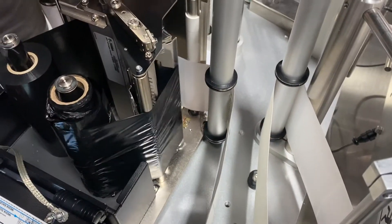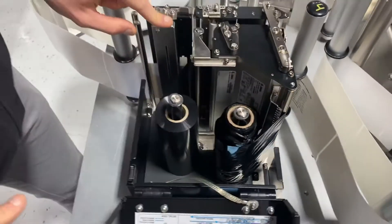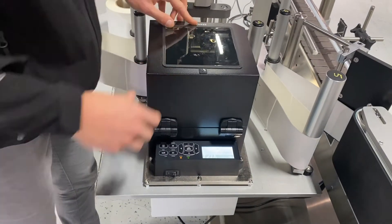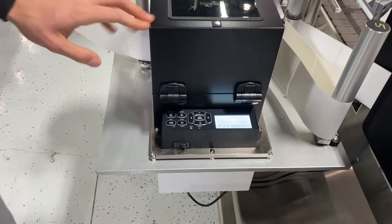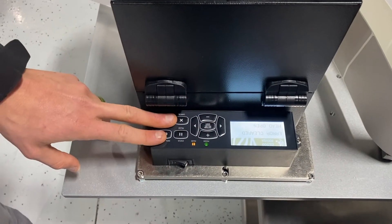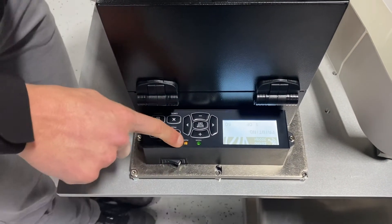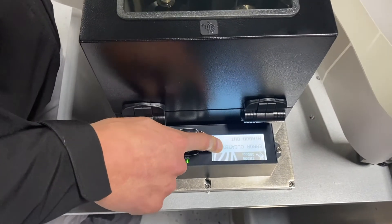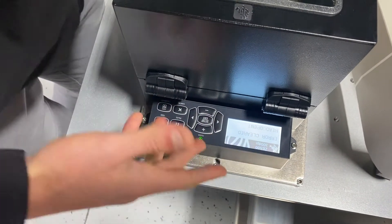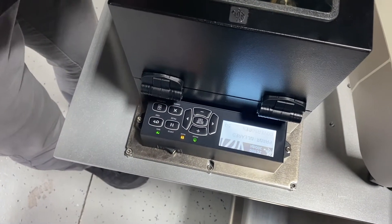I'm pretty flat across the top. I can now close my printhead, have my web sensor closed, and now I can close the cover. Now we're going to start looking at the settings and the operations of the control panel. I have a pause light on and it's flashing data — it's saying error cleared, ribbon out, cover open, head open. That means all of my problems have gone away.